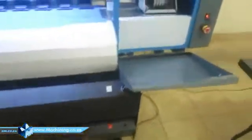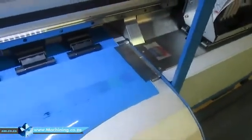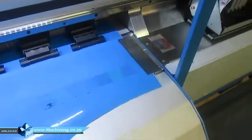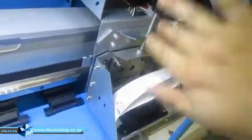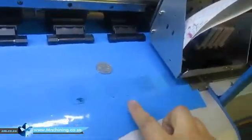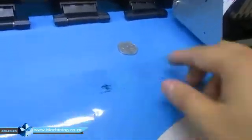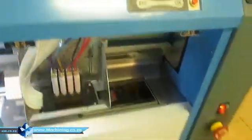I'm going to make a video about how to do alignment on computer for different thickness of printing medium. When you change the printing medium, if the difference in thickness is less than half a millimeter, you do not need to physically change anything — by physically I mean adjusting the head height. The height from the printing medium to the bottom surface of the printing head is about two millimeters.